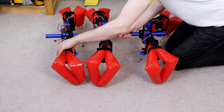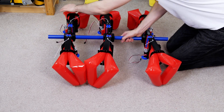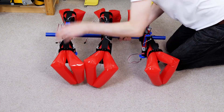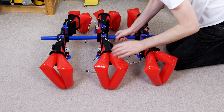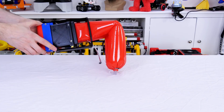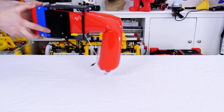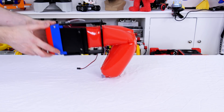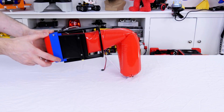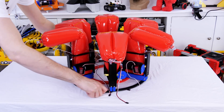However, even trying to support its own weight this isn't very successful — mostly the actuators just collapse when they're pulled tight with those bungee cords, so the legs are in the bent position. Each actuator looks like it's okay individually, but it skews quite a lot in one direction and there's nothing really stopping it moving that way, and that's why it falls over. So it's time for a different configuration.